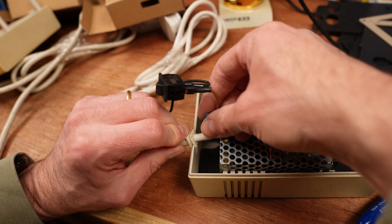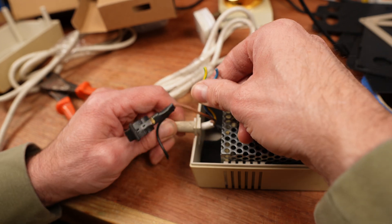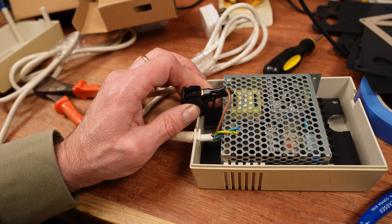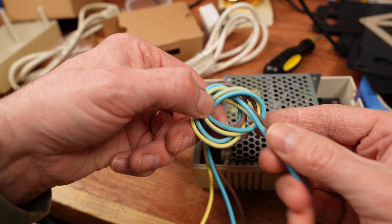Testing the fit, it looks like the incoming mains wires are pressing too hard into the metal case, so I snip a little off the outer sleeve to give them more room. The switch connectors sit above the Mean Well casing, but only with the switch the wrong way up — I work this out later in the build. The wires however are much too short to reach where they need to go, so I'll be extending them with some suitable wires salvaged from a similar cable. There are all kinds of ways to join two pieces of wire together. I'm sure that soldering them and covering them in heat shrink tubing would be fine, but solder isn't the strongest connection and with free floating cables subject to vibration I worry that the solder could end up cracking. For similar reasons I won't be using screw terminals that I can't fix down.